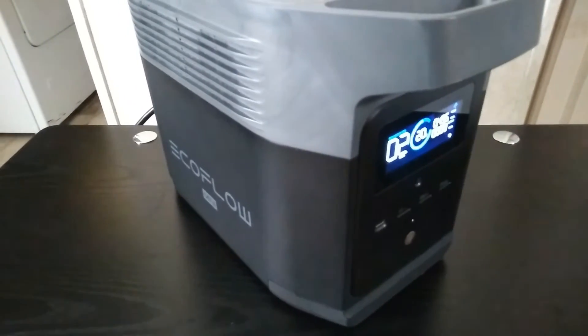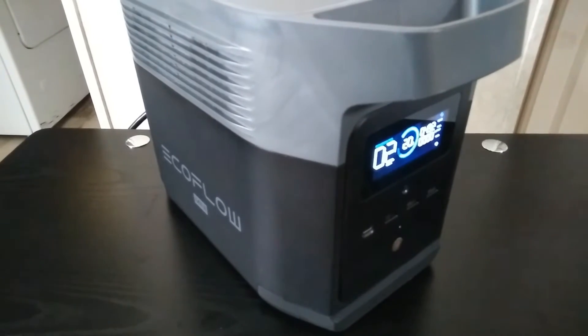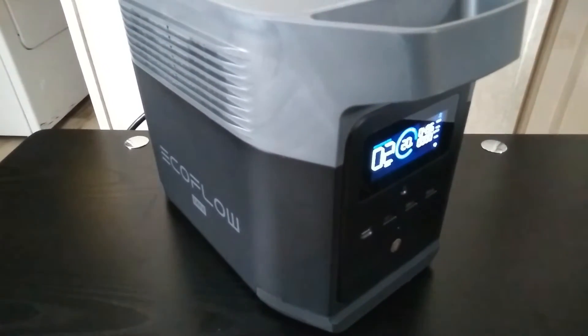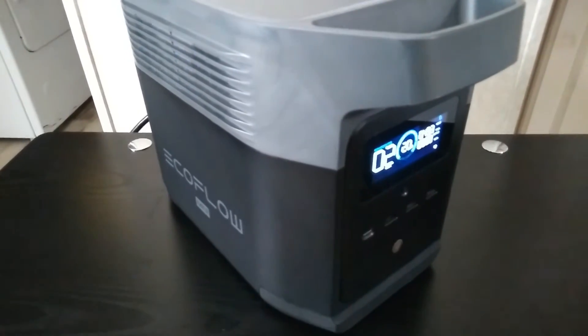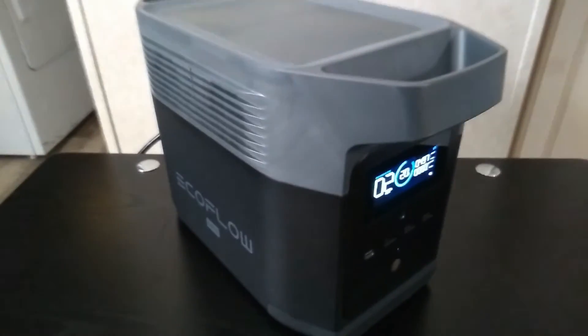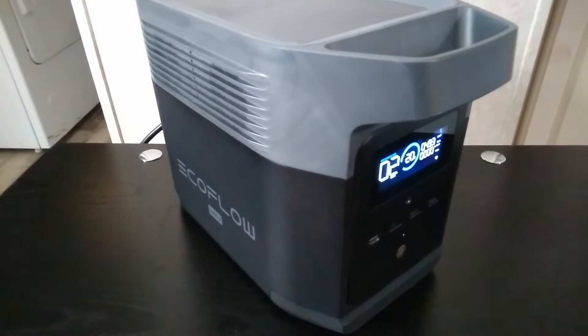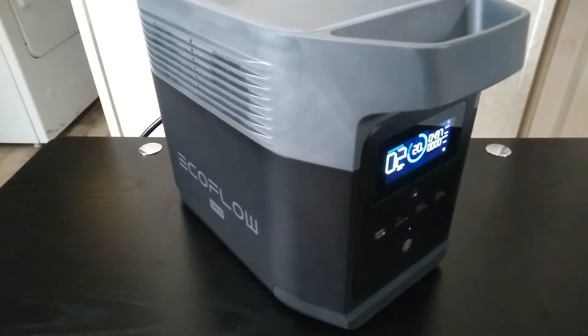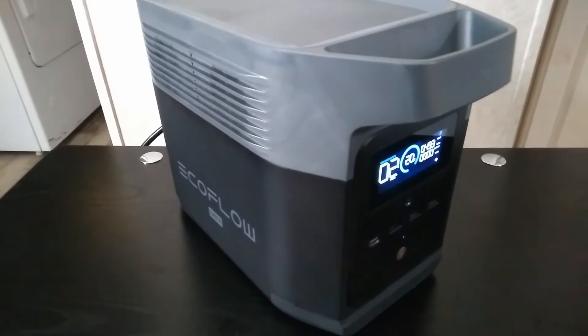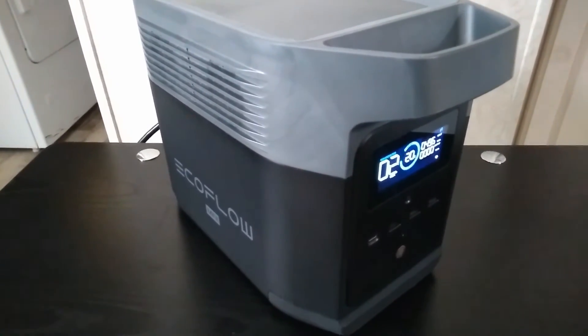This is one of the main causes for reducing your life cycles, or the total life of your battery. Obviously this is a main driving factor if you have lithium-ion like this unit here. But it's also a factor on LiFePO4 — it's just not to the same extent.